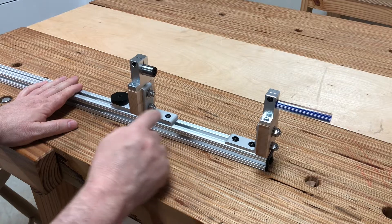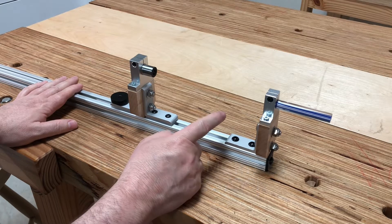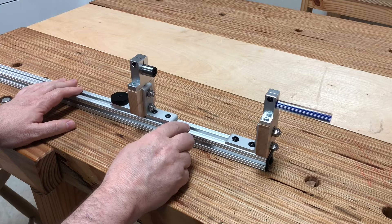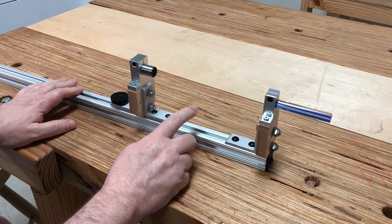The drill bushing is aligned with the 12 millimeter rod, which results in dead-accurate spindle mortises. This offset design allows you to drill spindle mortises up to six inches wide and from five inches to 30 inches above the seat. Most importantly, this design allows you to drill spindle mortises from underneath, which you would do for crest rails or other non-chair making operations such as casework, stairs, etc.